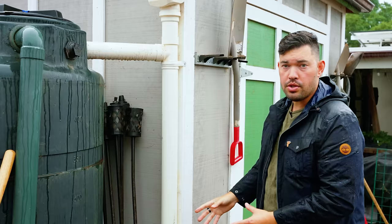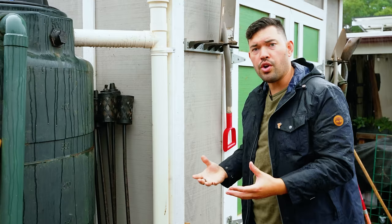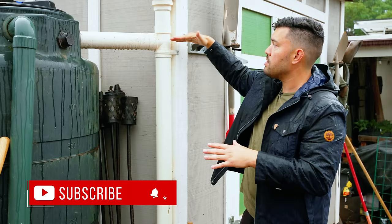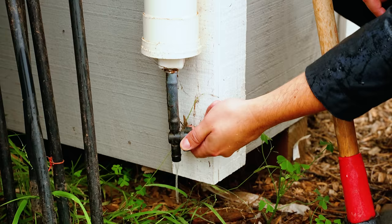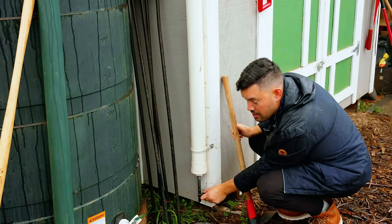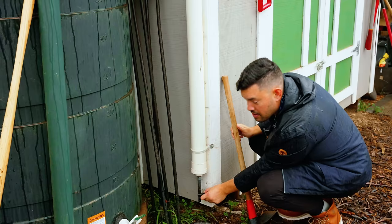Now what's this long tube that's not going into the rainwater tank? This is what's called a first flush filter. What this does is capture all of the finer particulate dirt and dust that falls through the leaf filter but that we don't want in the rainwater tank. It fills up this tube with the first 10 to 15 gallons worth of water, and then the clean stuff, once it reaches that level, will start to filter over into the tank. Every time it rains, there's a little valve at the bottom — you purge that valve, all the dirty water comes out, so that the next time it rains it fills up the first flush filter again.